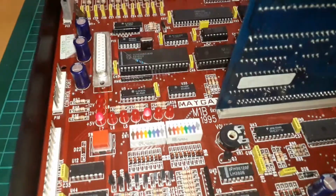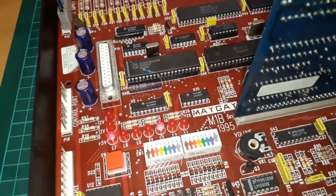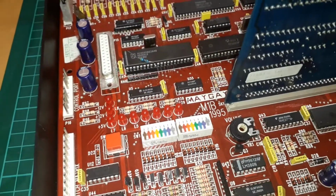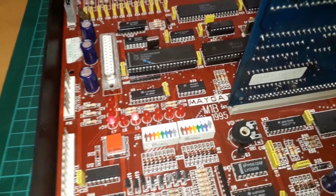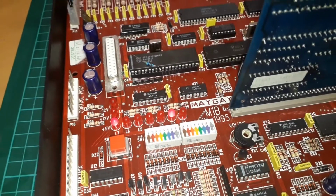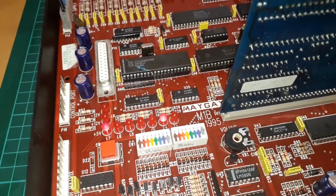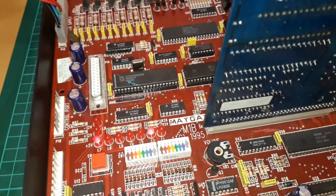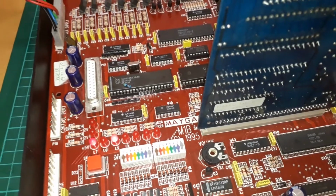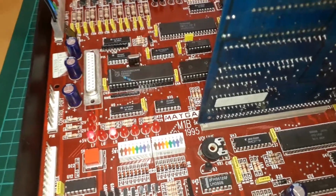You can quite clearly see that one's working. And if I turn it off and I turn it back on, there's no delay in the reset whatsoever. So I'm pretty sure that this hot start thing I'm seeing here, and I've seen it in a couple of other boards as well, is a glitch with DTAC, and I think it does need the pull-up resistor.